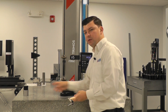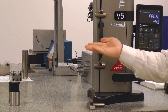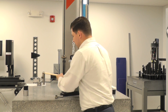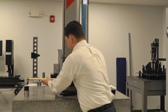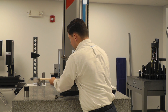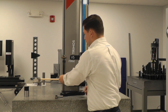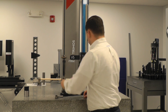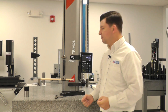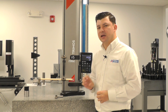Initially, you'll notice that as we took out our standard probe holder, the weight being released from this holder had our carriage rise up a little bit — that's why we're seeing a negative number. If I then add my larger probe extension — this is adjustable at whichever depth you may like — we'll set it slightly back, we don't need the full extension, and lock that into place. Now you can see I have positive numbers on my display, meaning it's sitting a little bit heavy. We're going to go ahead and adjust our balance to compensate for that weight.